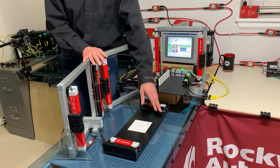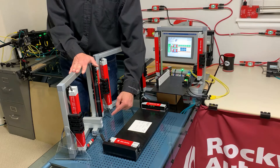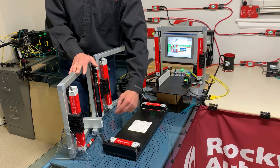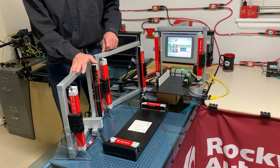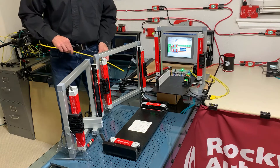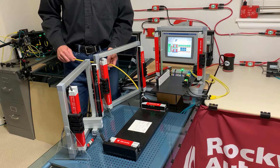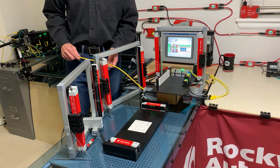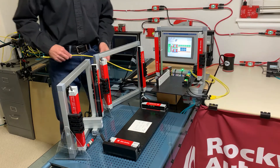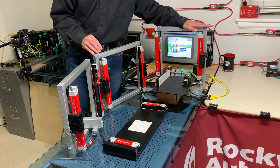We are showing simple on-off. In this section, we're showing fixed blanking, where we can teach a permanent part of the machine to ignore — for instance, a conveyor going through the light curtains. In this section, we have it set up for reduced resolution, which is often called floating blanking, where we can ignore one or two beams — for instance, a sheet of steel coming out of a galvanizing cell or an electrical cable coming out of a curing oven. And on the left here, we will shortly be digging into multiple modes around muting.